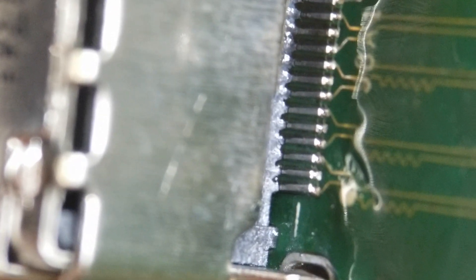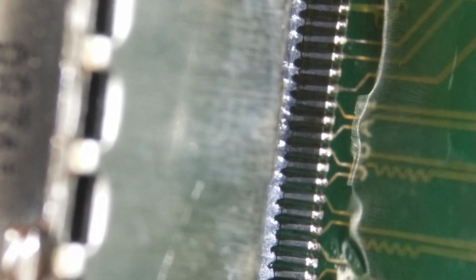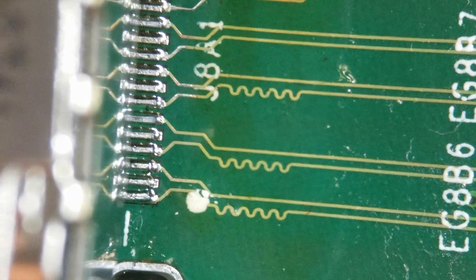I'm going to check the underside of these pins and make sure that there are no shorts at the ends, because that's very common - you'd find that the pins will have shorts or like a solder blob bridging over ridges. Actually it looks really good.